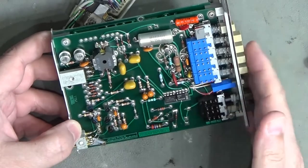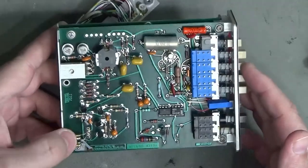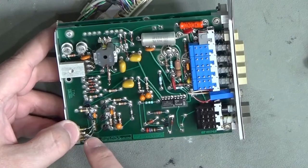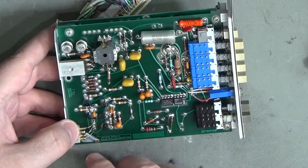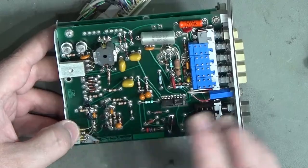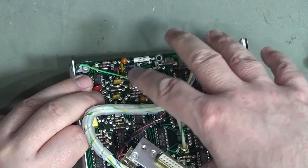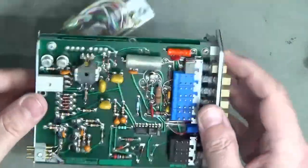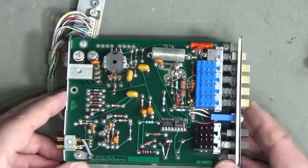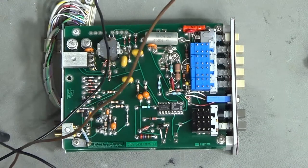Let's try and find out what's wrong. As always, we need to start our investigation with the power supply section. We can take the board off as it has the power supply on it - that will be beneficial for fault finding because it will separate it from all of the load. If there's a problem with the load, the power supply will work. I'm going to have a quick probe with it connected and just see what voltages I get.